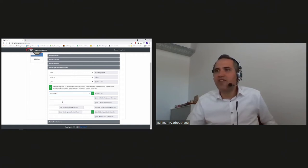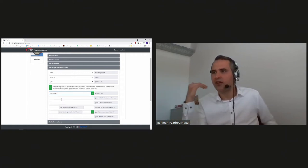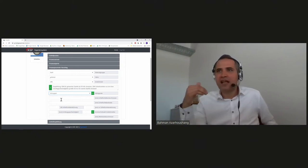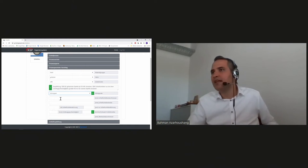Let's start with roughing. When you do roughing, you want to have really high material removal rates. You want to achieve most of the stock removal in the shortest time. And here at the next step, you need to give some information regarding grinding wheel diameters.